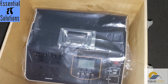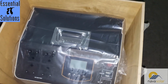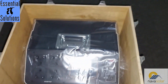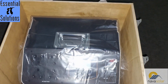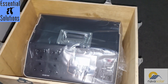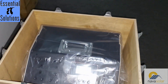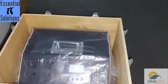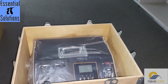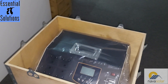It's strong enough to load your fridge, your TV, and some lights — up to about 3000W in total. Just a reminder: if you put a full 3000W load on it, the battery will only last about 50 minutes since the battery capacity is only 2.5kWh. On a 2.56kWh battery discharged to 80%, you've got around 2000W available. So for a two-hour load shedding period, you'd want to keep your load at around 1000W.